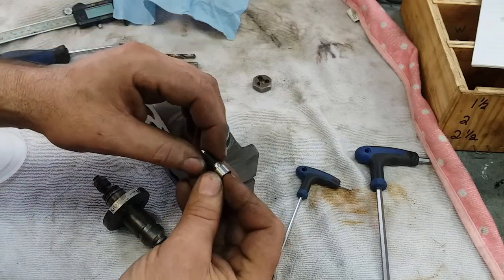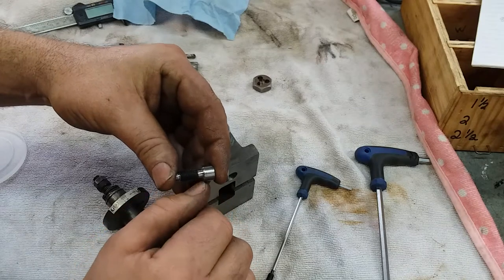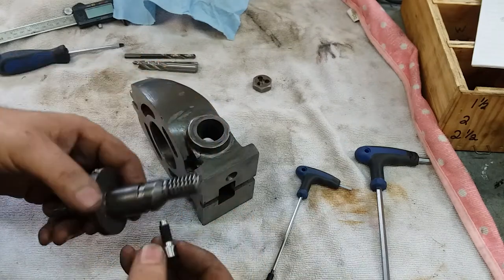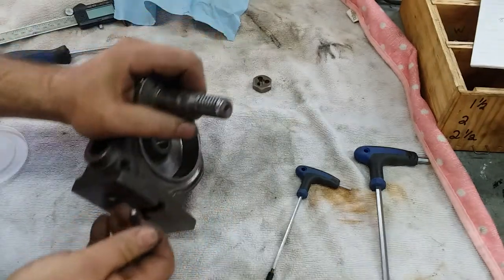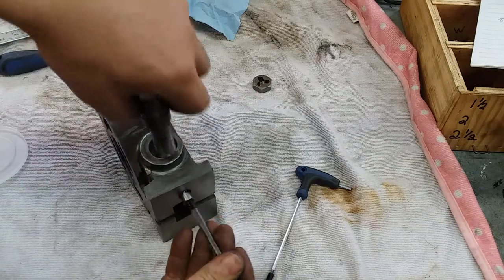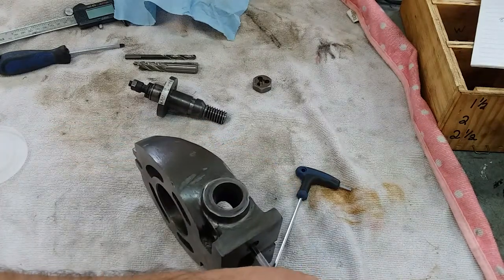I ended up cutting a little thread gutter here just so that nothing bound up back in the back corner, where the head is what's — 100% the head is what's holding that, not the bind of the threads. The diameter — you just want the diameter to fit that trench. And by trial and error I figured out how deep to make the pin protrude down into the bore. I doubt this can be shown on camera because the lighting is terrible in this shop.